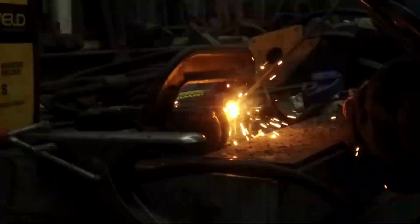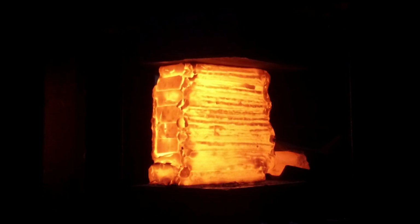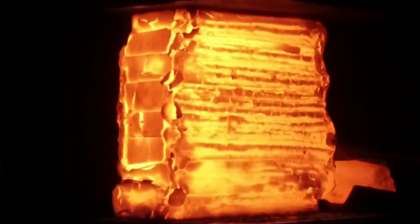After I've done the cut and restack, I'm going straight back into the forge and then onto the hydraulic press to squash that back out. I've done a slightly taller, higher stack for this bar. This will just give me a few more layers. Each piece that I've cut already represents about 18 layers, so if you multiply those, it'll be pretty easy to work out how many layers I'm working on.